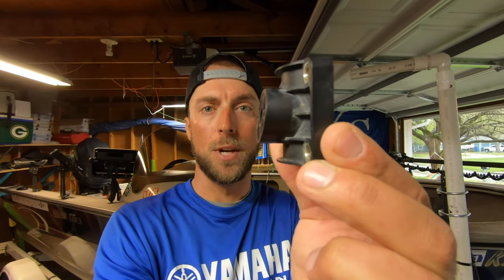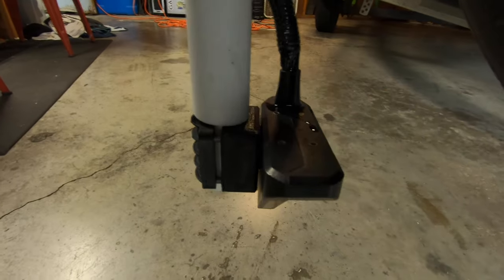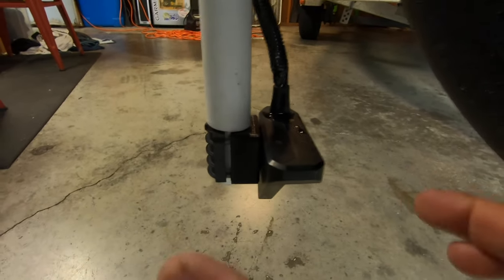Along those same lines, I've now upgraded my mount from the one that live scope came with to a zero-degree offset mount. The original mount that live scope comes with is at an eight-degree offset — that's because it's made to be put on a trolling motor, shooting that angle away from the shaft itself. But with that eight-degree offset, when you drop your bait right down in front of the transducer, you're not going to be able to see it — it's actually off to the left just a bit. By upgrading to the zero-degree mount, you have no offset, so when you drop your bait right in front, you're right in that 20-degree cone.